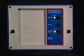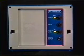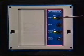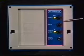The Model 902 transmitter is powered by 4 C-cell flashlight batteries. 902 transmitter push-button controls include an on-off power switch: depress once to turn the instrument on, press again to turn off. Batteries need replacing when the light no longer glows green.